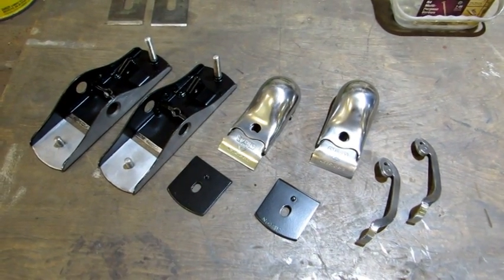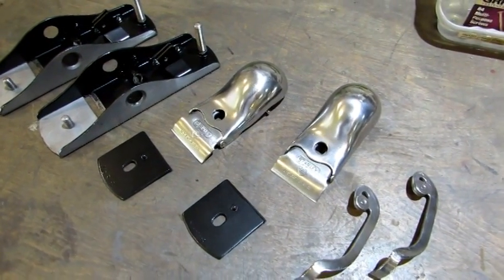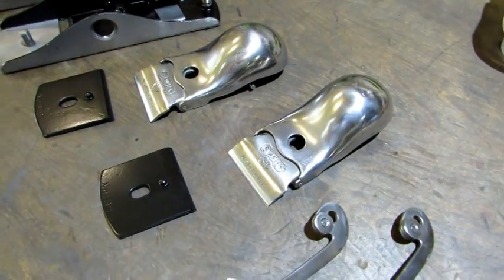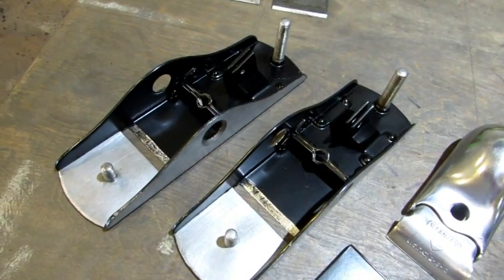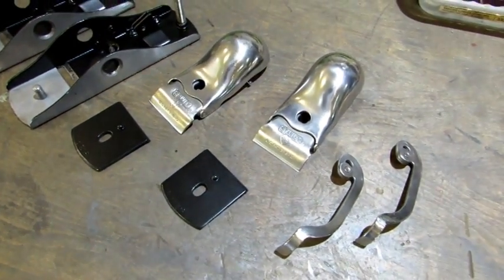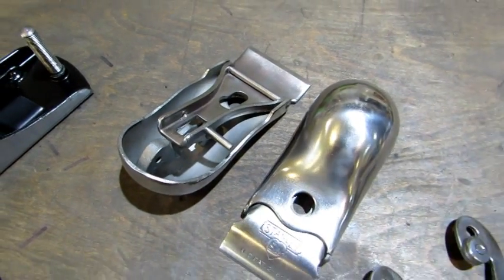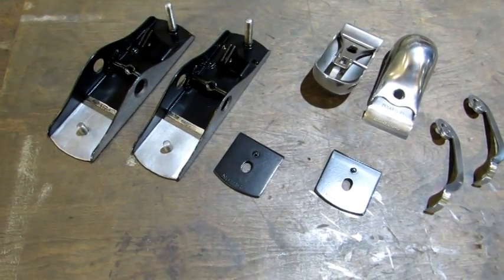The finished parts are piling up. The caps are done — they've been blasted, sanded, then buffed on the wheel and they turned out looking really nice. Three coats of paint and then the final coat applied to those parts. On the underside of the cap, I knocked both pins out — leaving them hanging like that makes it easier to clean them. The next thing I want to do is wipe these painted parts down with my dirty oil rag.